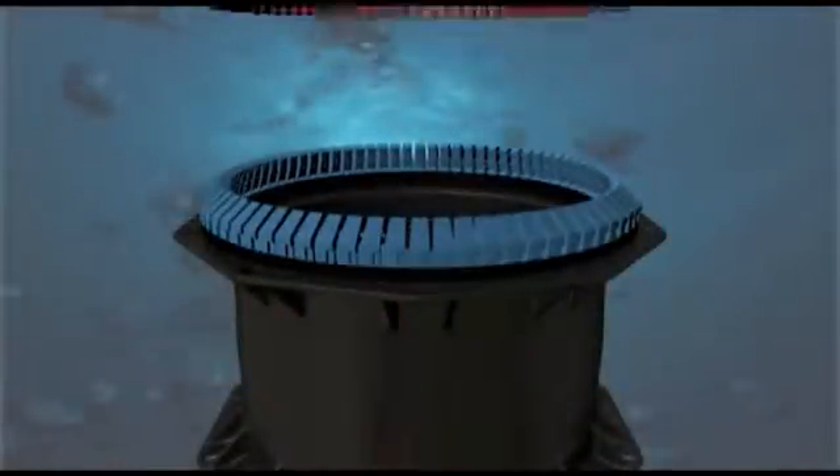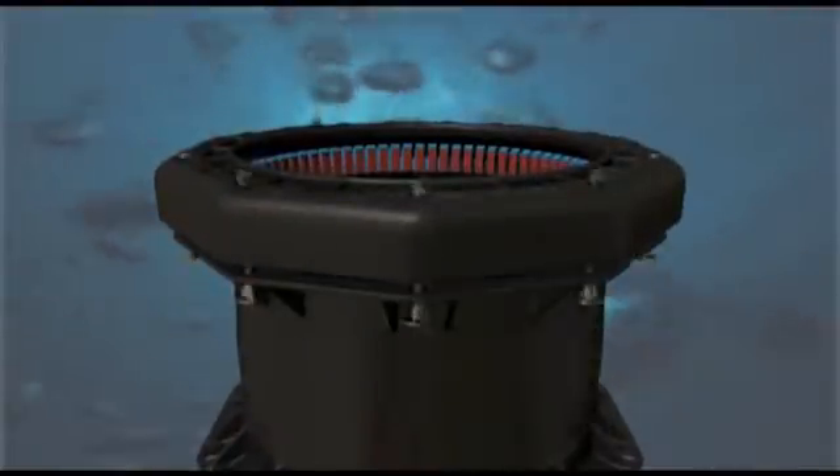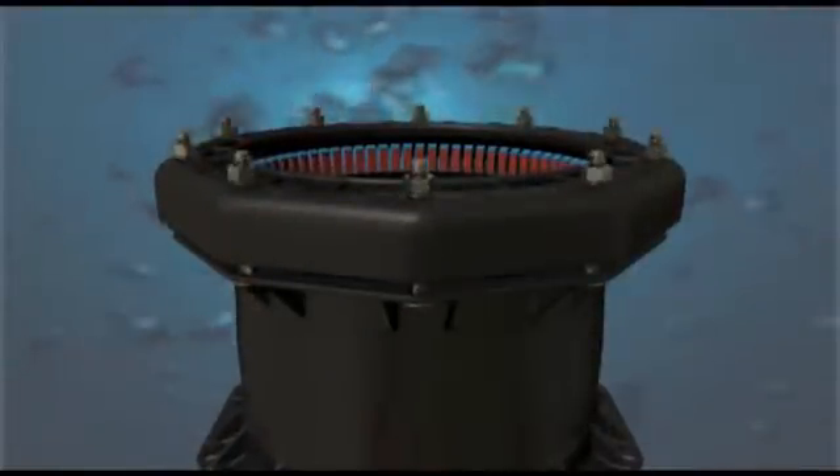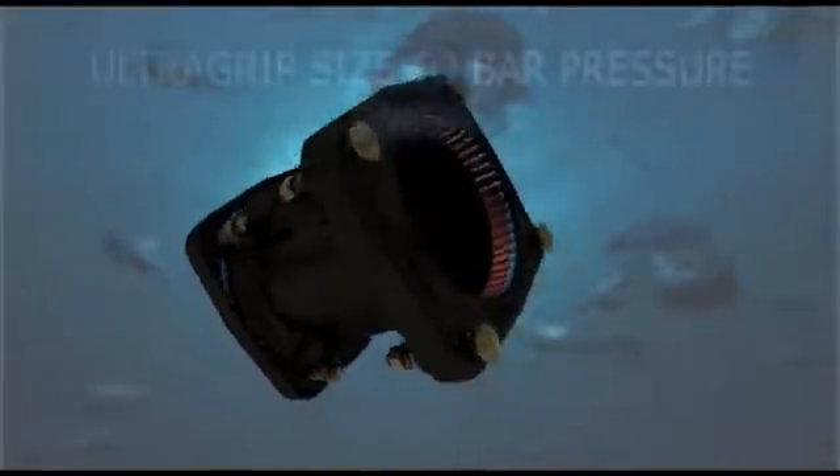The gripper and sub-seal assembly can accommodate up to 44mm pipe outside diameter variation depending on nominal size. Last but not least, UltraGrip has a new robust design that protects and retains the plastic components both during installation and for the life of the product.